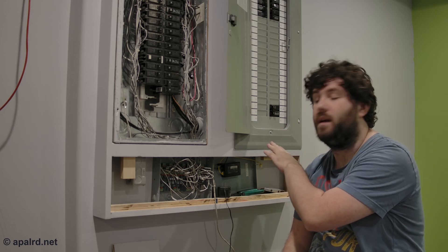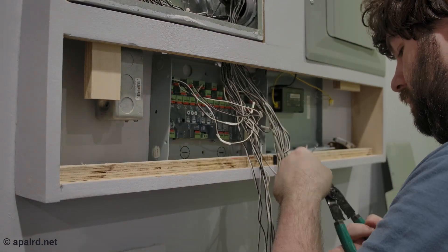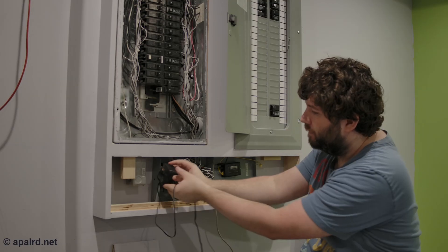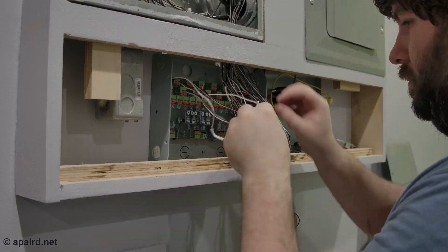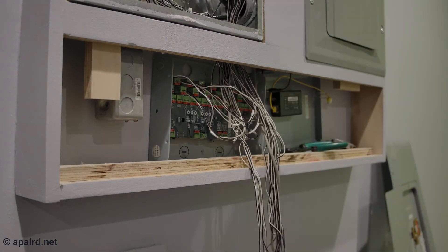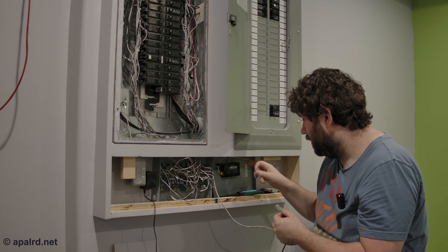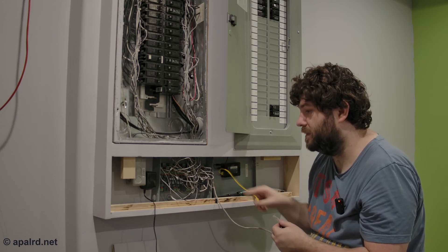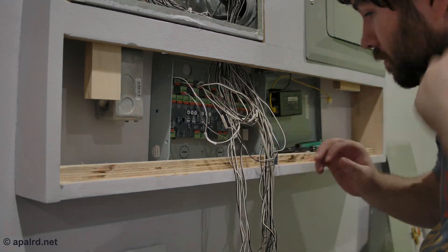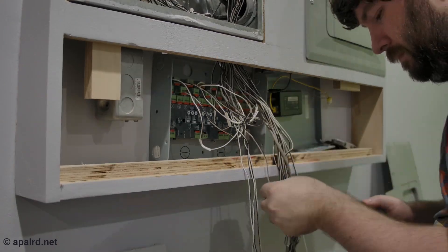I think I need to get another monitor for this panel separately, because this one gets fed by the generator and this one doesn't, and I'd like to be able to monitor the voltage on both panels separately. This thing only has one voltage monitor, which comes from this 12-volt AC transformer brick. I can plug it in right here — basically this plugs into a port on the unit and this is how it measures voltage. It doesn't use this for powering itself; it actually has a separate 5-volt input. When the power goes out, this thing disconnects, which obviously makes sense because it's powered by AC power.